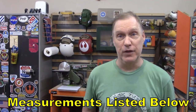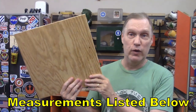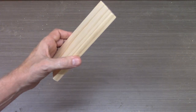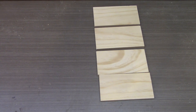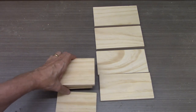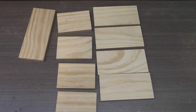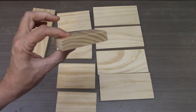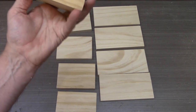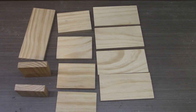To make this, we have to cut some wood. Here are the measurements. First, cut a 14 by 14 inch piece of plywood — I'm using quarter inch, which is probably the minimum for the weight this will hold. For the mount structure, use half inch thick, three and a half inch wide pine: cut four seven-inch pieces (the hangers the nail guns sit on), four five-inch pieces, and one eight and a half inch piece. Then from three quarter inch scrap, cut two bottom pieces for the nail holders — one three and a half inches deep by two and a half inches wide, and the other three and a quarter inches wide.